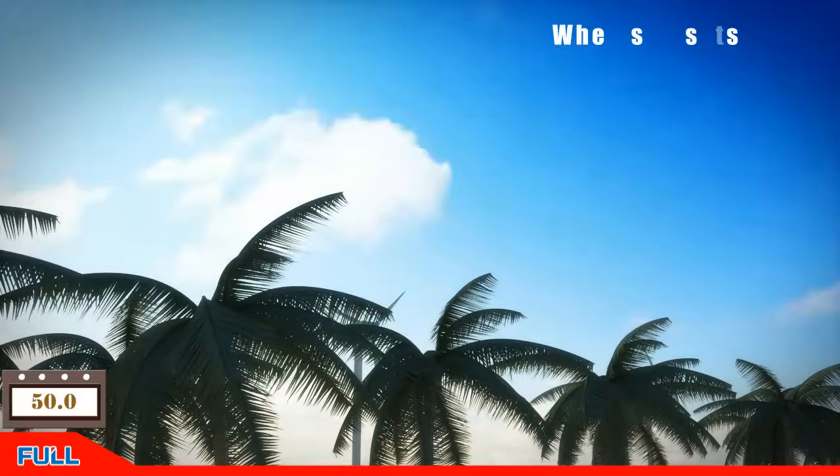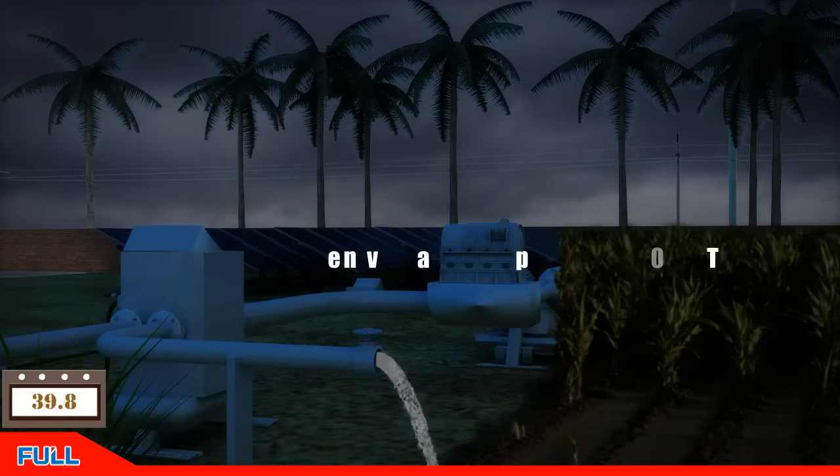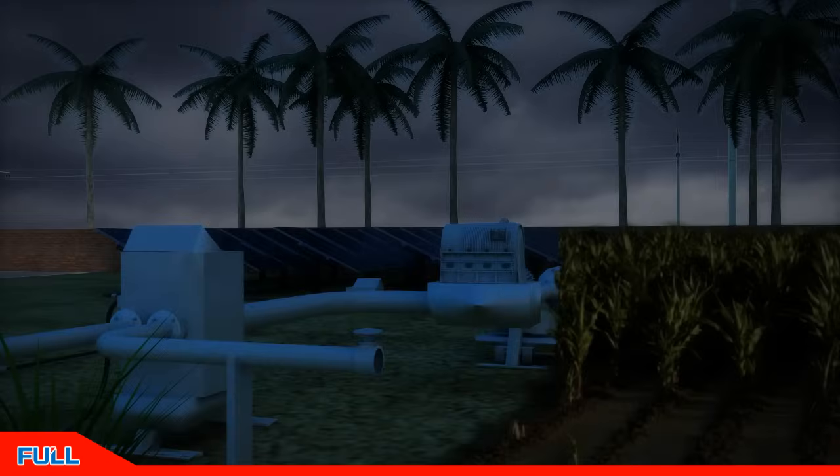When the night falls gradually, the sunlight weakens and the output voltage of the solar panels reduces. The drive begins to reduce the output frequency to maintain the pump working. When the voltage drops lower than the maximum power point voltage, the drive will stop working. When the voltage is below 100 volts, the drive automatically turns off the internal power supply and the drive screen will be off, waiting for a new round of sunrise, when the drive will work again automatically.